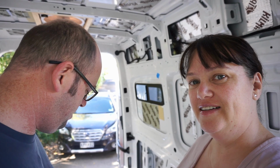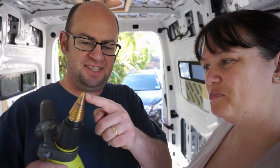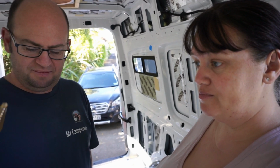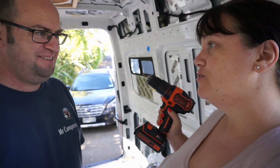Prior to drilling down, I countersink it just a little bit, just the head. Even though the screws are self-tapping countersink heads, I just felt that this gives a bit of an advantage getting it all the way home. We've figured out that the process is really fast if Darryl goes around with the driver with the self-tapping conical step drill, and then I follow behind with this. To be fair, I actually follow first with the vacuum cleaner, cleaning it up so that we're not screwing little particles in. So we think we'll probably finish this job, famous last words, pretty early.